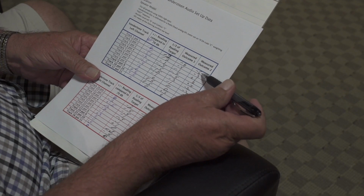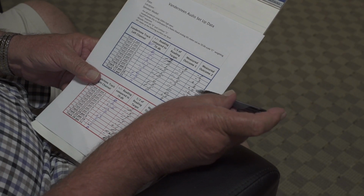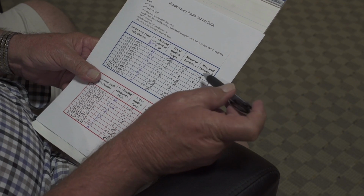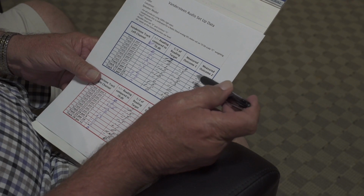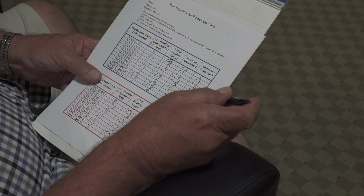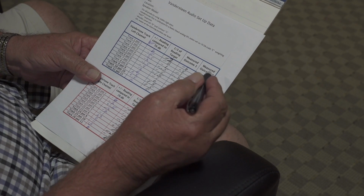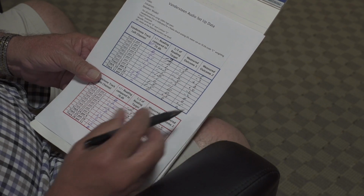0. You'll see in this case here that we are within plus or minus 1 dB of the first outcome, so we won't make any adjustments. That's well within. Remember now, these measurements are with the speakers in the room. Very difficult for speakers to attain this kind of flatness even in an anechoic chamber, but this includes the room.